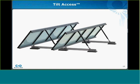Tilt access is another feature that those who know the legacy system will be familiar with. Tilt access is slightly different here. The key of tilt access, there's two real benefits, and it's that it allows you to tilt the panels up further than the designed angle to allow easy access for wiring and also for maintenance over the lifetime of the system. Easy access to the roof or any of the underlying features of the array.